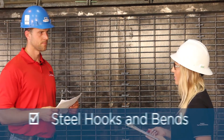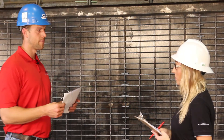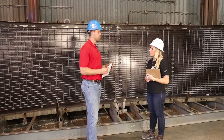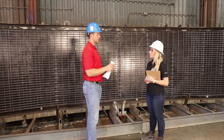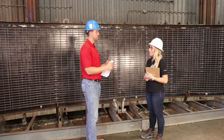Next we're going to verify hooks and bends. On this assembly we have two 90-degree bends on both sides. The key thing to look for is kinks in that bend and thinning of the steel around the bend — it's a visual check and we would look at every single one of these bends. If you encounter a problem, you red flag it, get your reinforcing team up immediately, halt production, and do not let it pour. Correct the issue, get a double-check to confirm it's correct, then continue production.